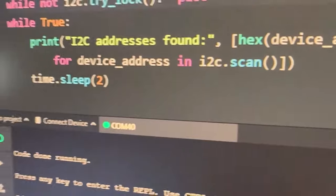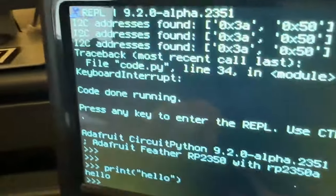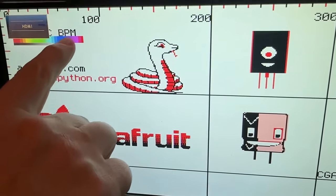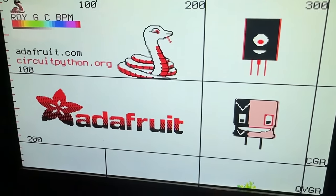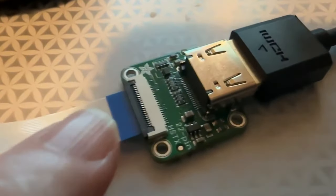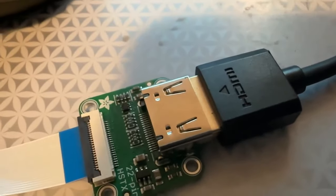This is the demo. I can print hello, and it shows up over here because you have the REPL mirrored. The demo we've got displays a bitmap image — this is just a color test so you can see color output, and we can display a bitmap image. It does some dithering as well. I also hooked up I-squared-C so it can read the EEPROM of the DVI display, and you can connect it to any HDMI monitor. This will be coming soon to the Adafruit shop.